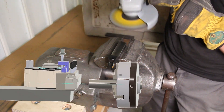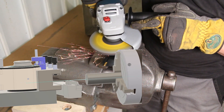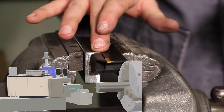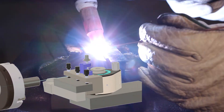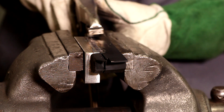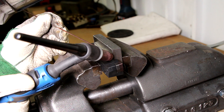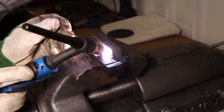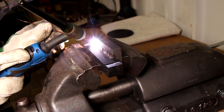And here's my idea: I want to position the tool in front of the holder so I can move it downwards, and I will do that by welding a plate on top of it that I can then clamp into the tool holder. Now the tool is too far down, but this way I have room for adjustment with the adjustment screw. I figured I'd rather modify the cheap import tooling than the more expensive parts of the lathe, and I think this is a pretty fast, straightforward and simple solution. Only downside: I have to modify every single tool, and every time I get a new tool I have to modify it again. But as this is a pretty fast and simple modification, I think it's worth it and I can live with it.